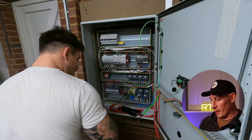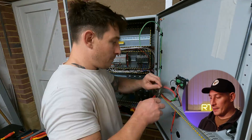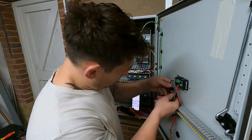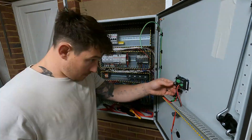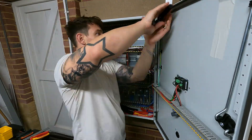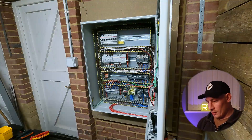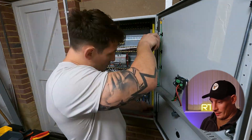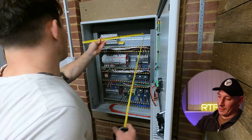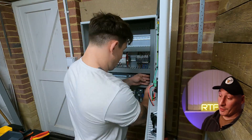That red and black cable is the 24 volts to the touch screen. If you want to learn more about electrical schematics, there's a link in the description. Finishing off the earth to the door and within the panel, bottom left-hand corner. I'm getting the trunking lids cut — I get quite particular about this, making sure they're absolutely perfect, especially the horizontal ones butting up nice and tight without warping the vertical ones.